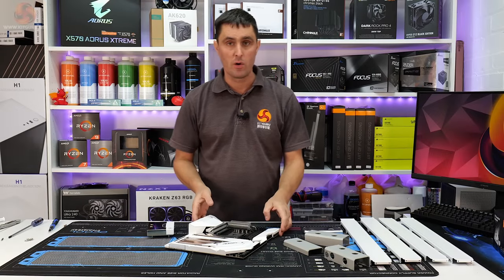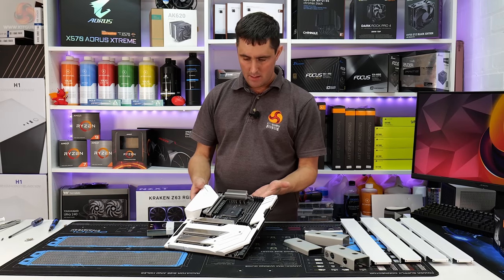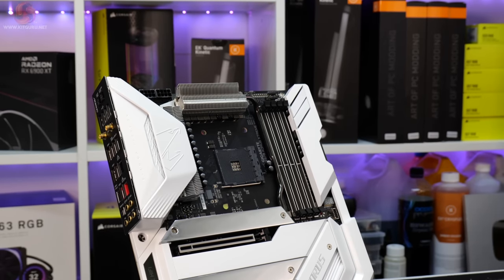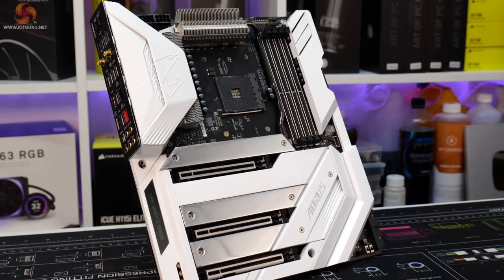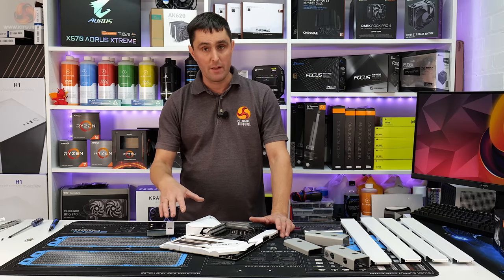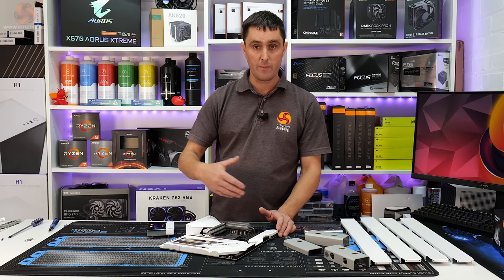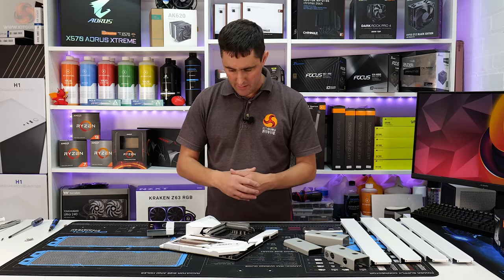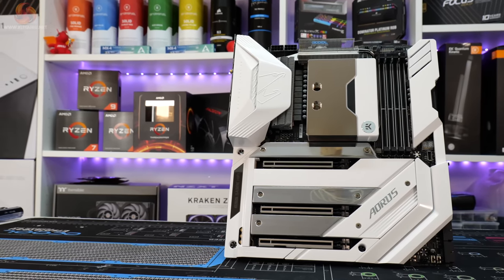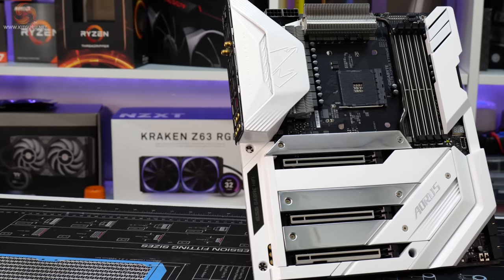We made some decent progress. The motherboard mod is complete, as you can see. That's looking exactly how I expected it to, so that's good. You'll have seen from the early bits of video that I completely disassembled the motherboard, all the heat sinks, everything removed from the motherboard. All the aluminium parts I soaked in a caustic soda solution to strip off the anodized coating. They were all back to the bare aluminium, and then most of the parts are painted white. Obviously, that's the color scheme that we're using with this system, except for the M.2 heat sink.